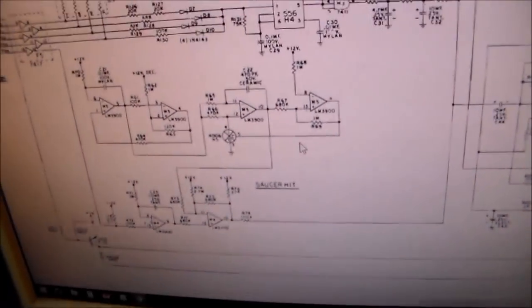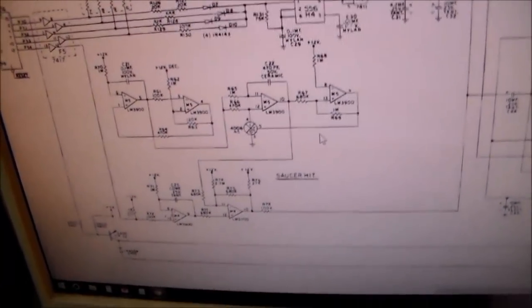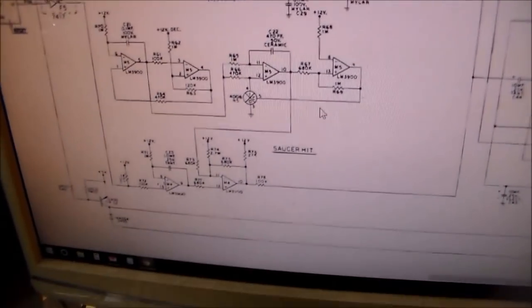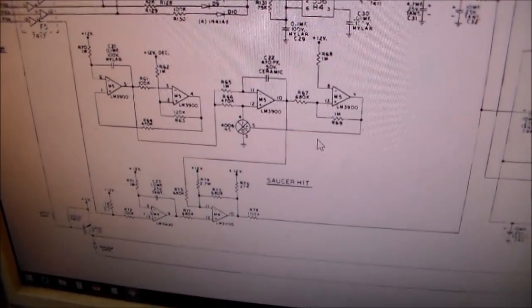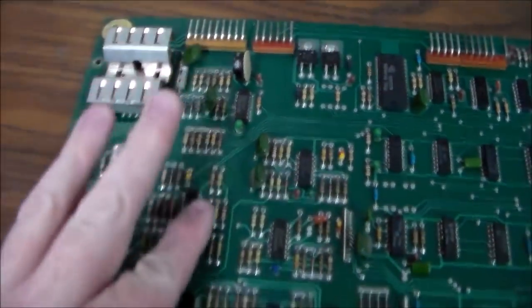And this is kind of an annoying one because I'm going to have to play it again and shoot the UFO. You know what I mean? It takes a little while to test it. But I'll go ahead and we'll swap that chip out. It's at M5, so if you look at the top of the board, this is row M, right? And if you look at the side of the board, there's another little number. 1, 2, 3, 4, 5. So this is row 5.